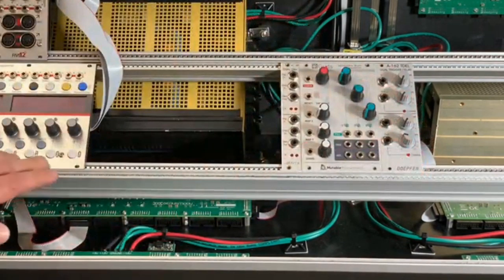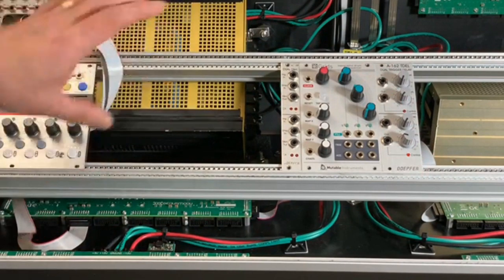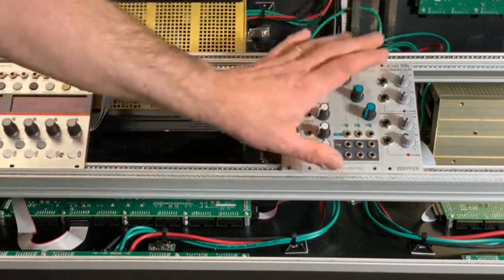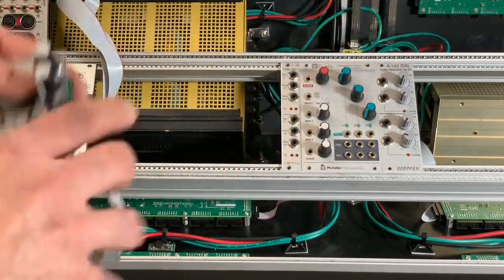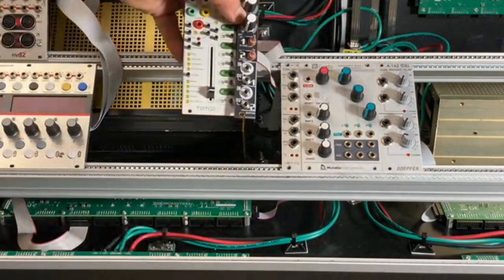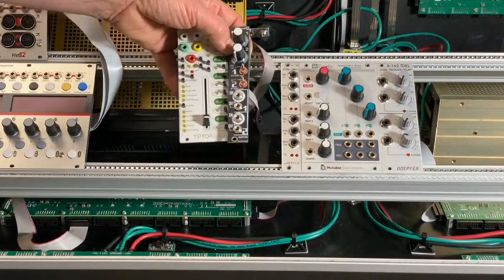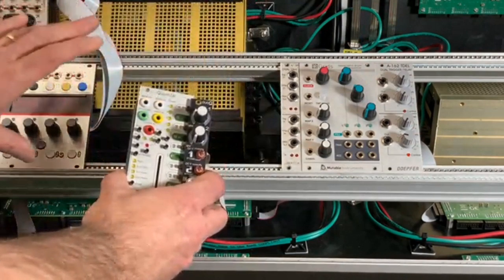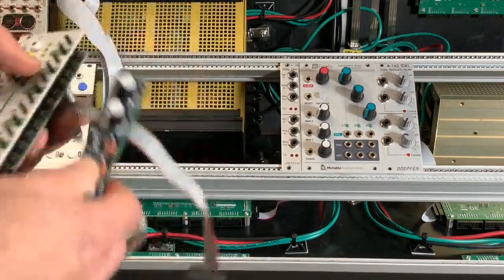But part of it is I want to have the sequence running. The 512 is very good at allowing me to have different note durations and rests. But then I also want to take other modulation voltages, trigger them rhythmically tied to the master tempo, but then if necessary, introducing the next modules I'm putting in, quantize those voltages if I want them to also generate other notes that are more random accents than the planned out sequences in the main sequencer. That makes a lot of sense.